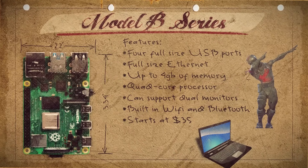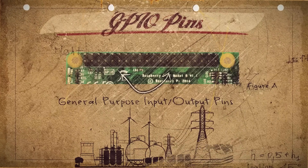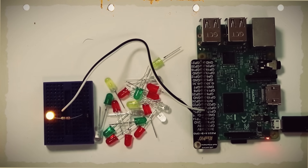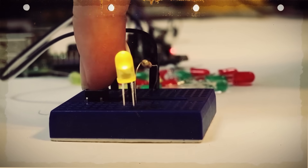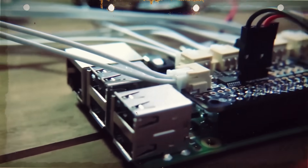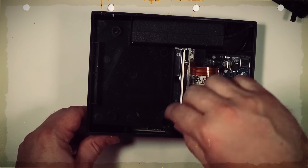So having a cheap full-fledged computer is cool, but let's address the real reason this Pi has become so popular — this little pin cushion right here. These things are called General Purpose Input Output pins, or GPIO pins for those of you that don't like long words. These pins can send and receive electrical signals, and you can control those electrical signals from the operating system. Being able to control electrical signals means you can control a lot of things that use electricity to run — things like LED lights, motors, buttons, switches, radio signals, audio signals, and even LCD displays, just to name a few. You could make a display that shows your YouTube subscribers, or even add joysticks and buttons to make your own mini arcade system. It's actually pretty limitless what you can do with these GPIO pins, and it takes the Raspberry Pi from the computing world to the physical world.